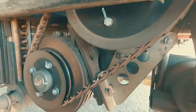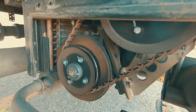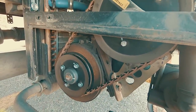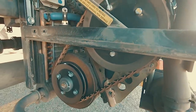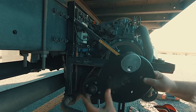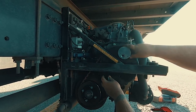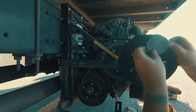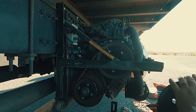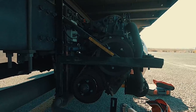This belt gets loose but it's adjustable — it's a linked belt, so it's adjustable. You need a special tool to get this belt off and on, which you can pick up at any Carrier dealership. I'll post the part number down in the description. To use this special tool, we need to get one of these bolts off because the tool fits in there just like that, and it comes with a bolt to mount it to the wheel.